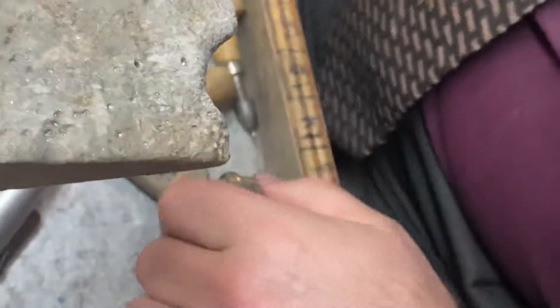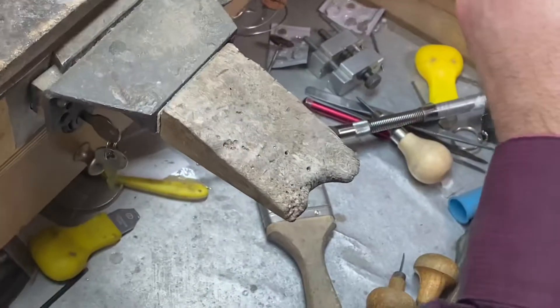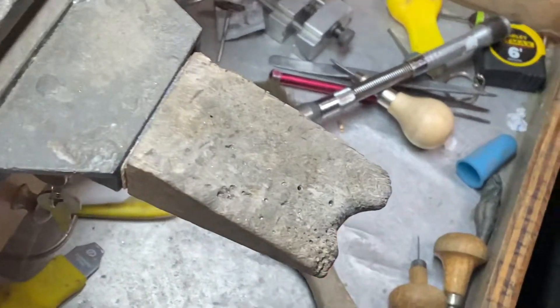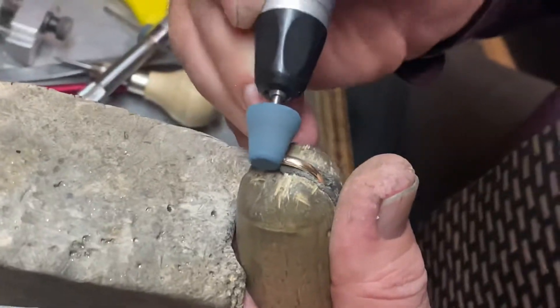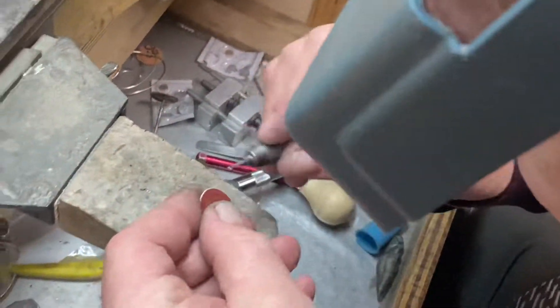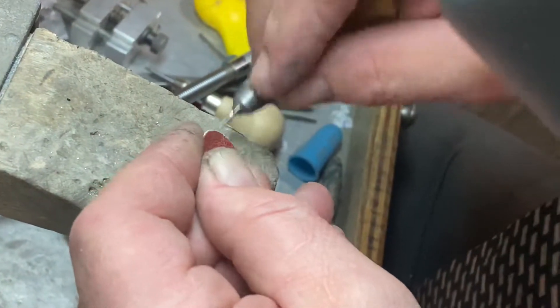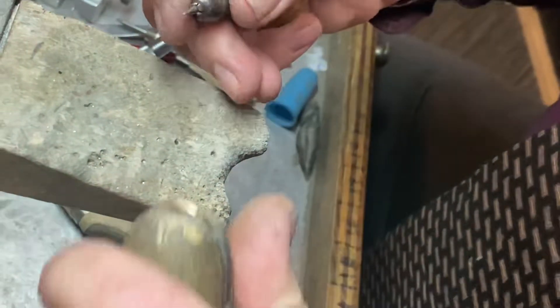This is just to clean it up. I always recommend you make that burr really, really shiny — hit it on sandpaper, maybe 1800 grit, to make it really shiny inside. Then I put a little bit of oil, use a much finer sandpaper, and go on the inside to finish it off.